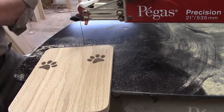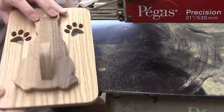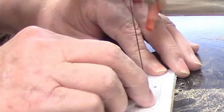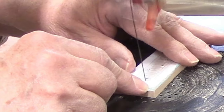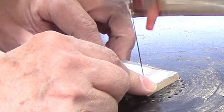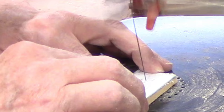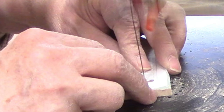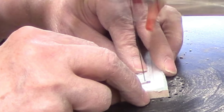I peeled the pattern off the backer and set the dog against it for a preview of what this will look like after the glue-up. It's shaping up nicely. Cutting letters requires extra patience and attention to detail. For most patterns I cut right on the line, but I usually cut on the inside of the lines for letters. My reasoning is that letters are, by nature, close together except for the spaces between words. This means that if you cut even slightly outside the lines, you run the risk of two letters running into each other. For letters like A and O, you have the possibility of the center section falling out — this could ruin not only that letter but the look of the entire project. I've had to toss projects with quite a bit of time invested because of one or two bad cuts.